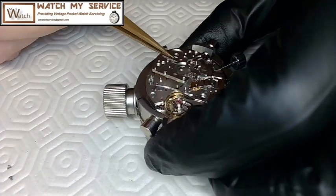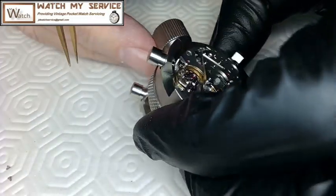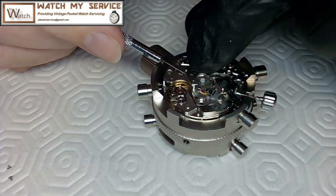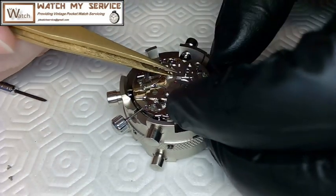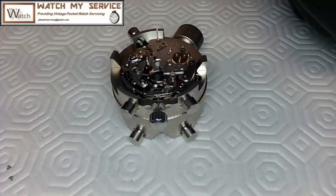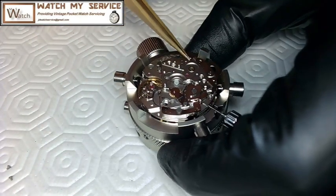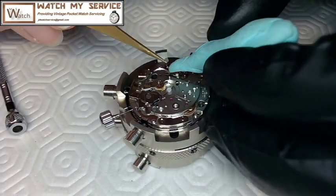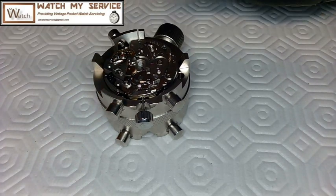I had to remove the existing screw and then screw through the top and plate — the instructions didn't mention that. Then the minute jumper wheel: I never took off the little spring on the side. It's a long spring that drags along the minute counter wheel. I screw everything down making sure it's nice and tight with all screws in place.